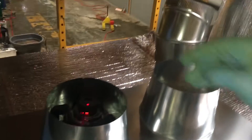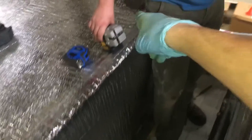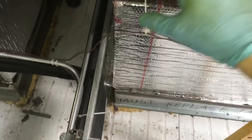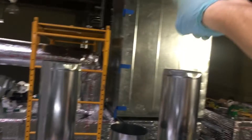This is where our feed air is going to come in. One is going to come off to the side and go over to this air handler right there to feed this side, and one is dropping into the air handler right here, feeding into that corner of the room. Through pressurization and mixing, it'll flow into and positively pressure this room.